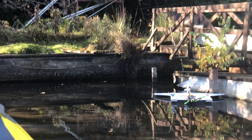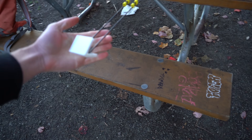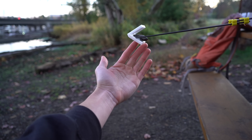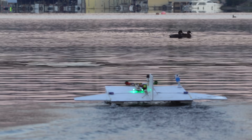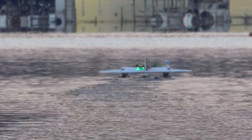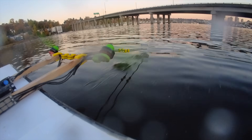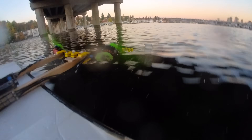Back to the video — there it is in the corner over there. This vehicle had a wedge-shaped wing to hopefully prevent it from generating any lift out of ground effect — zero aerodynamic angle of attack, but still a positive angle of attack on the planing surface so it can skim. This worked pretty well. It was able to skim just barely above the surface of the water, and I was even able to give it full throttle without just taking off and gaining altitude like an airplane. However, looking at the onboard footage, the motors aren't really even moving, so the control system wasn't really doing anything.